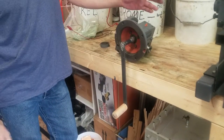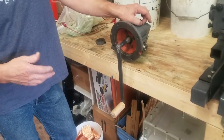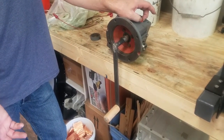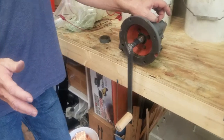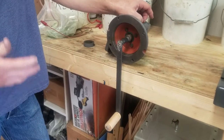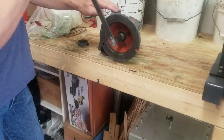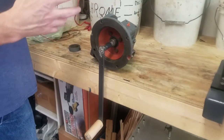The purpose for the gearbox is that 30 years ago approximately I bought an engine stand which is good for V8s. It's relatively small and you had to turn it by hand and use a little pin to hold it in place. Not particularly good if I want to do something like a straight six, and more importantly I'm going to be doing some straight eights on it. So I've made it much larger and stronger and I'm adding this 60 to 1 gearbox so you can turn it real easy by hand and put it in any position you want.